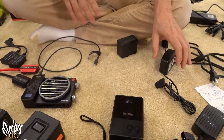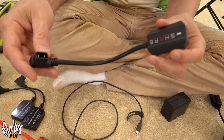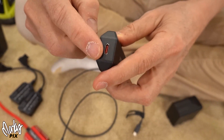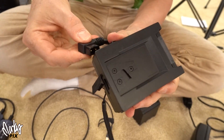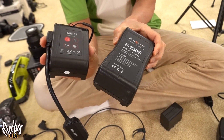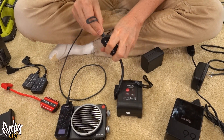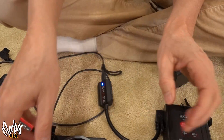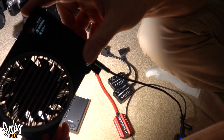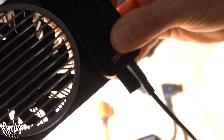So how do we do that? These are DTAP to USB-C PD adapters. You've got the DTAP connector on one end and a USB-C PD on the other. Plug in the adapter into this tiny little Cine TV DTAP battery — probably one of the smallest DTAP batteries you can get. Turn on the 100 watt light, and I'm cranking it up — 85, 95, 100. I'm getting 100 watts of power out of this tiny little DTAP battery.